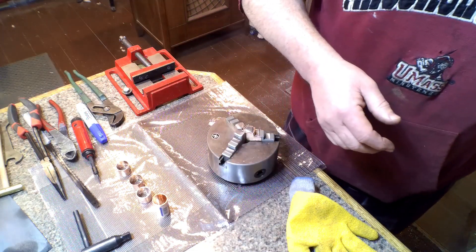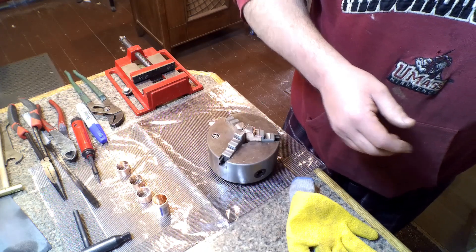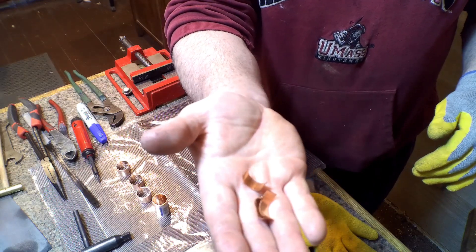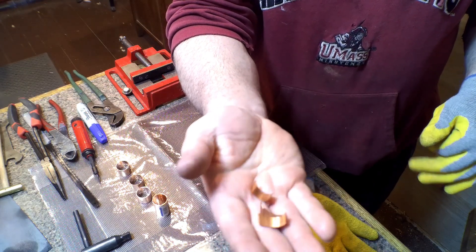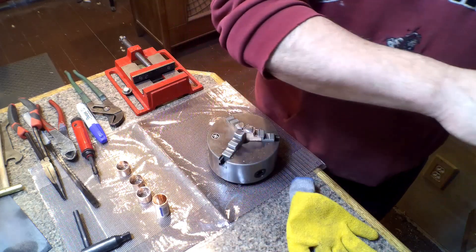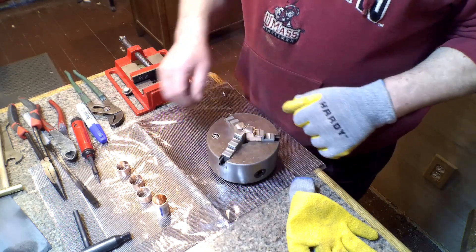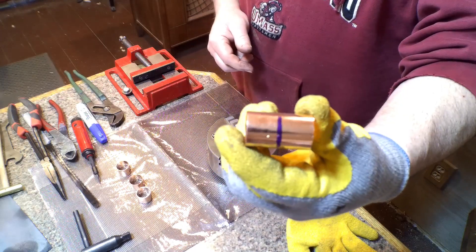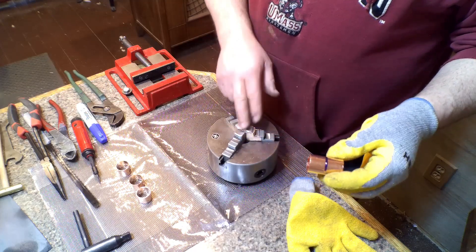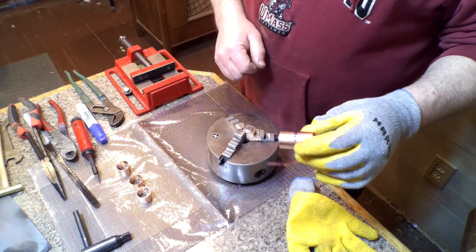When I made those other soft jaws I kept the little cut-offs — you can use those as low shims for other chucks and emergency soft jaws, they work fine, worth keeping around. On this lathe I already got the three-quarter inch pipe solder-on unions, and I practiced one already to make sure my design was good and it was going to work out.